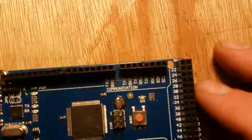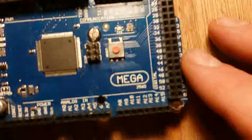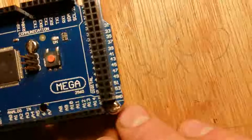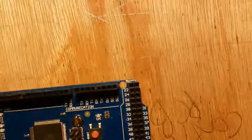Anyway, the working bits we're going to use are these, sorry about the focusing, these control terminals here. You can see this strip here starts with the common 5 volts there, and common ground there. The focusing is diabolical. That looks like about the right, numbered 22 to 52, and even though it's cut off there, the other side of that 22 is 23.